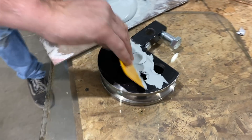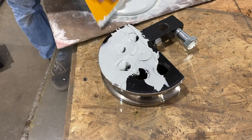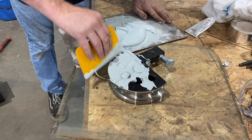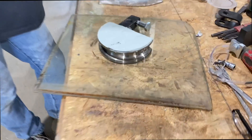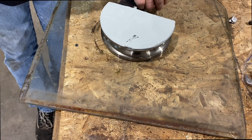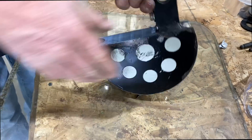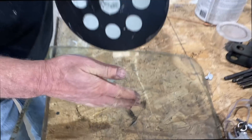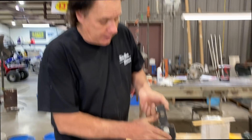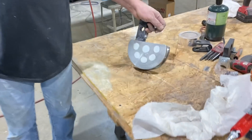Start and smooth it out and we'll have a good smooth die. All Bondo'd up — pretty smooth. This backside looks good. I just broke it off of the glass so the backside's already in pretty good shape. Once that dries we'll smooth it up just enough. I just want to be able to pull this out of the sand without the sand being pushed into the holes and tearing up as I come out. So that needs to be smooth. Got it sanded, got all the extra Bondo off — that should be nice and smooth.